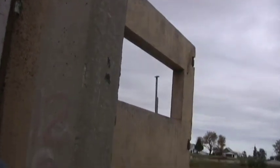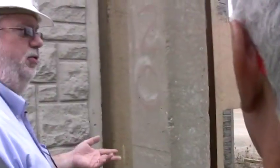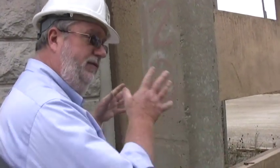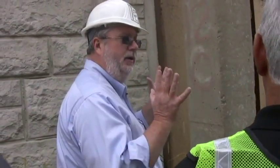If you take a look over this way, you can see the little lifting inserts on each piece. A lifting insert doesn't seem like a whole lot, but that one piece is rated for 10 tons — it can hold 20,000 pounds. So there's a 40,000-pound capacity with two inserts on this wall panel, which probably weighs 27,000 pounds. That's called a safety factor. Structural engineers and architects will always build in a safety factor in case one insert fails — they'll just pop rather than completely rip out.